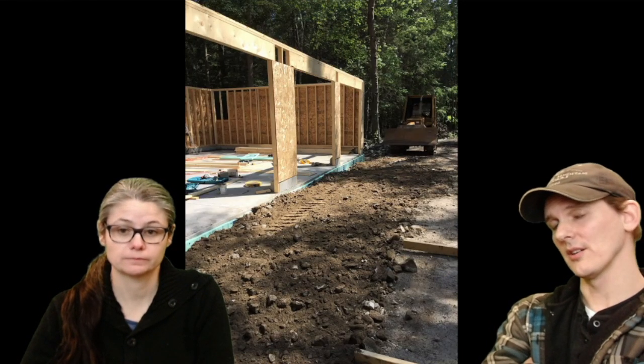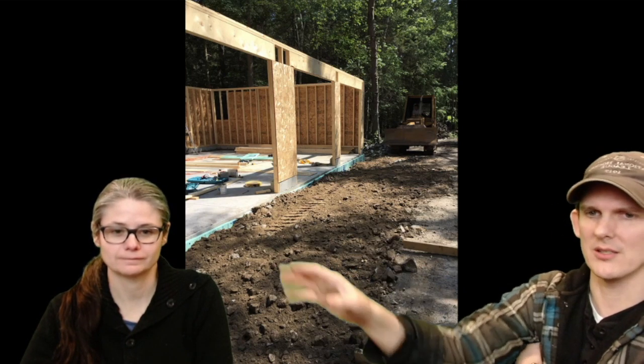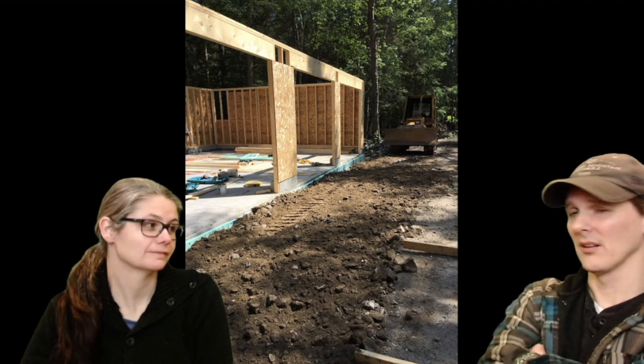So this is another lesson learned. This was a mistake. I should have done something here so that it would drain better. What I did is I ended up putting 4-inch gravel right on top of this, and then we put reclaim right on top of that. And it made this basically completely waterproof, so any water that's over here will actually go right inside the garage because you cannot get to this drain. So I don't know what the solution is there.